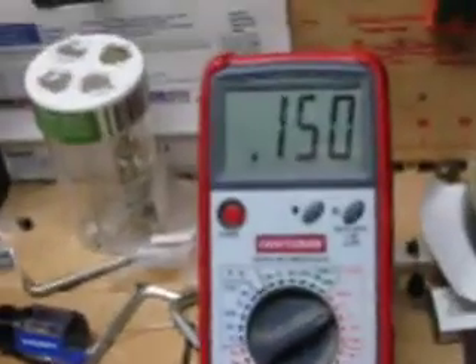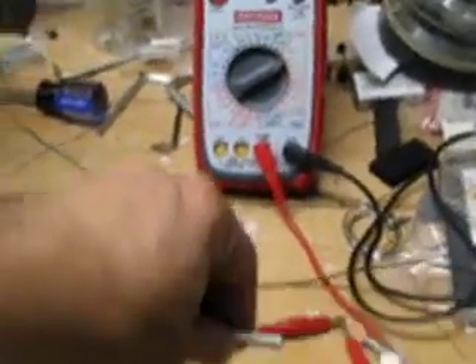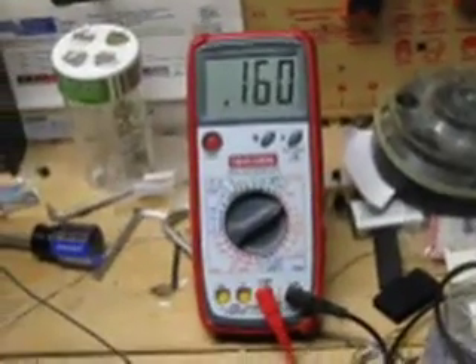The first thing we need to do is set the voltage offset that will be applied to the combined signals. This type of diode has a corner of about 3 tenths of a volt between the full open voltage — which is about 0.65 volts for a silicon diode — and the full cutoff voltage. So we want to set the voltage to be around half a volt.